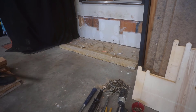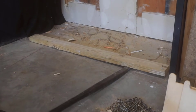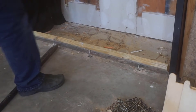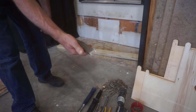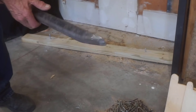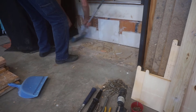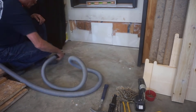The last remaining piece is a treated 2x4 anchored to the concrete with drive-in expansive anchors — no match for a stout spud bar. A tip ground like that gives incredible leverage and can easily tear out things held down far more securely than that little 2x4. A little sweeping and vacuuming and I'm ready to scribe the stair box.